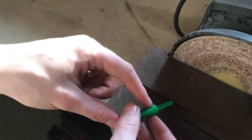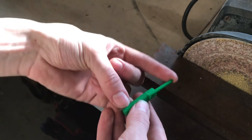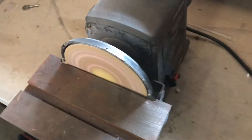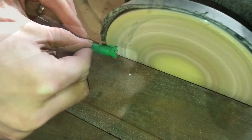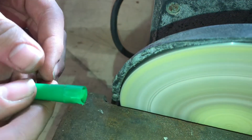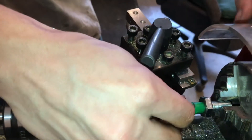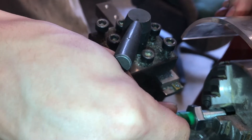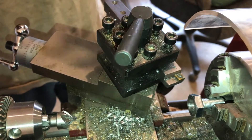In order to make sure this fits into our press fit on the screw we're going to get rid of this piece here by grinding it off. Now the plastic almost fits in here but it's just too small so I'm going to go ahead and drill that all the way out to 3/8 now.